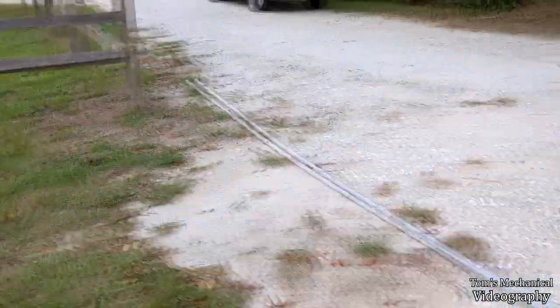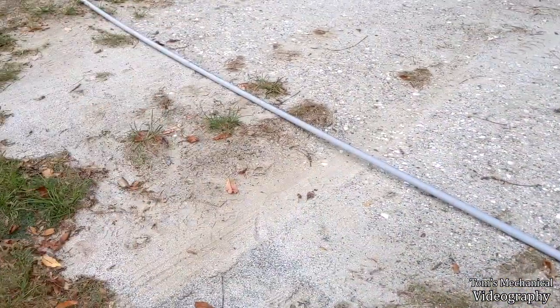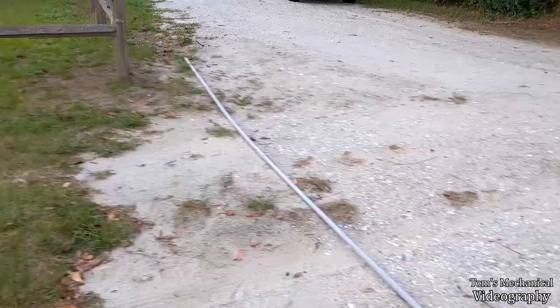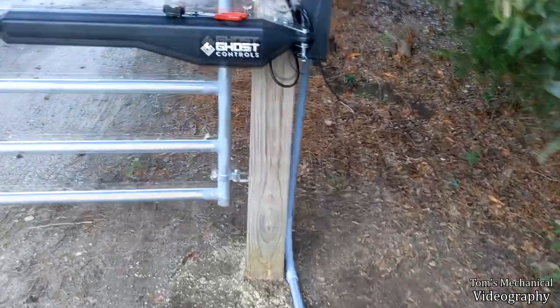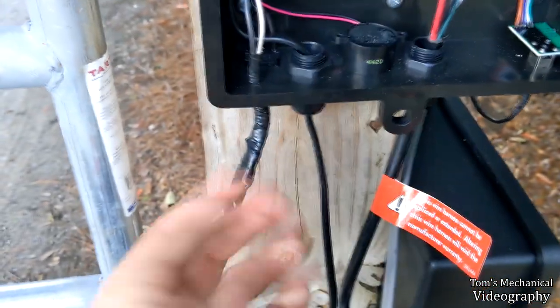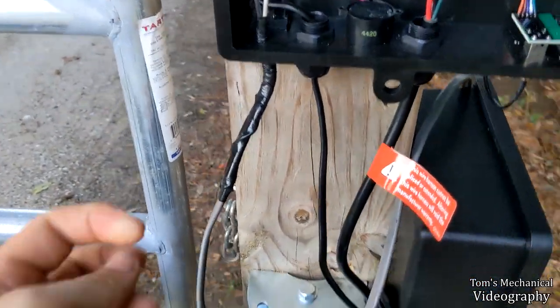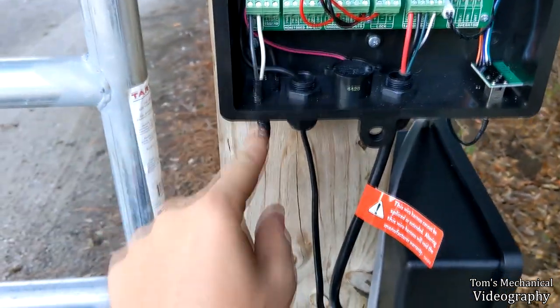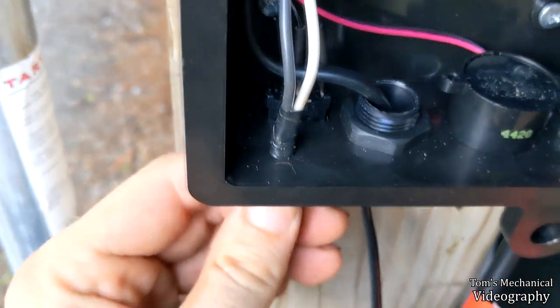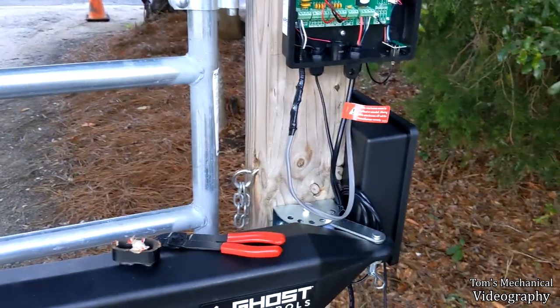Time to dig. I've got to get a tarp so I can go underneath the shell sand and pull the sand off without getting dirt on top of it. I've just got to dig a ditch for the next couple of hours and hopefully work in headlights. Also, regarding the solar wire entry into the box: there's just a hole in the box with no gland fitting. I took some UFB/Romex, peeled it back to the two strands, left about an inch or two of jacket on there, and wrapped it in electrical tape - that's a damn near perfect fit and will be watertight for the most part.